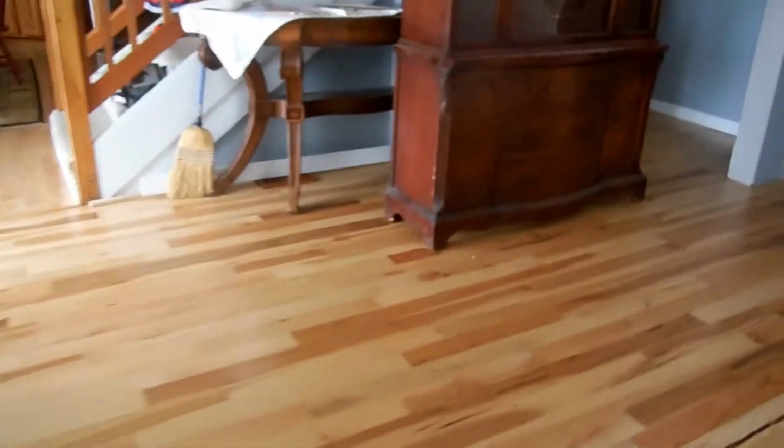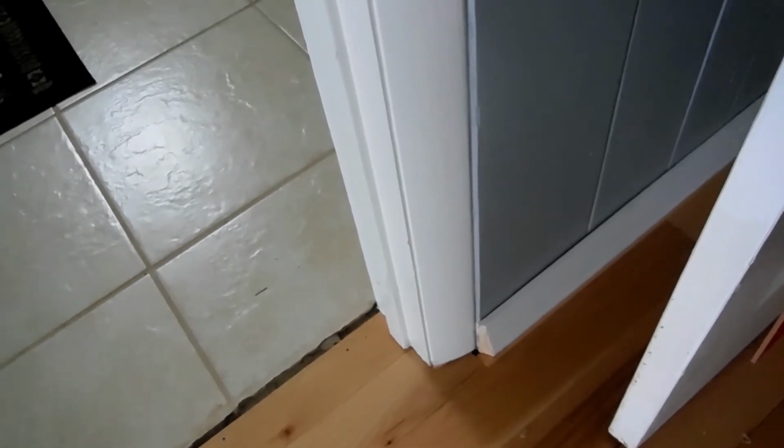I did this one down here, I believe at 42, but I actually think 43 would have worked better. And these right here where they end at the doorway, it's got that wainscoting, so I'm just doing a 31.6 degree angle back the other way on those, because I figured that would work the best. Again, that one's 45. That's a 42 degree angle is what I ended up with. That one should have been 43, but it seems like 43 degrees was the best.